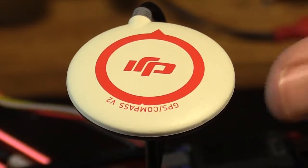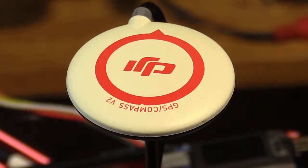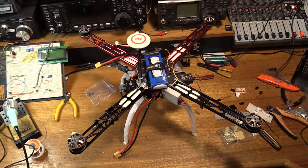One other thing I've done is turned the puck 10 degrees around to the east, just to compensate for the magnetic declination here. So that's the build so far. The next task will be to take it outside and test the GPS and all that sort of stuff.